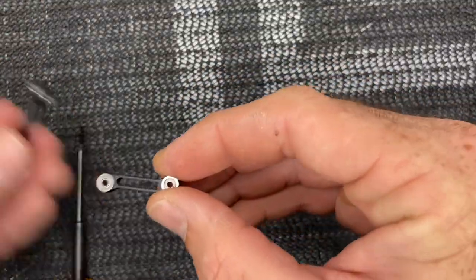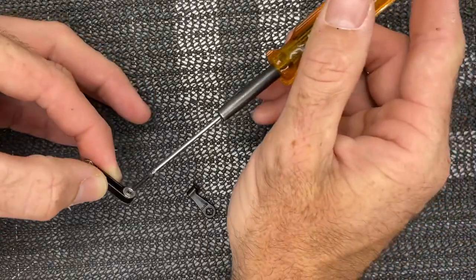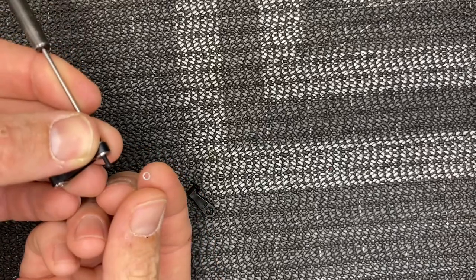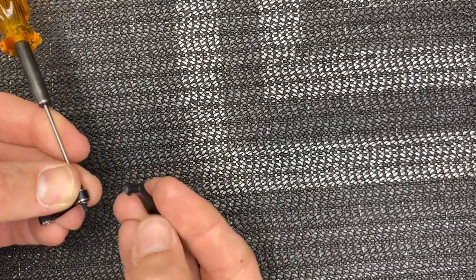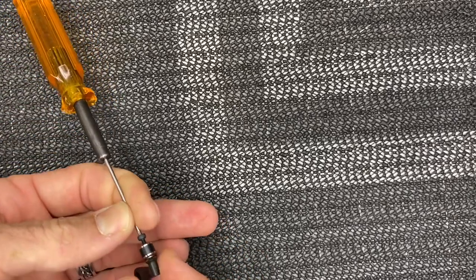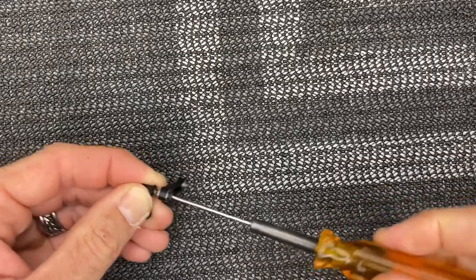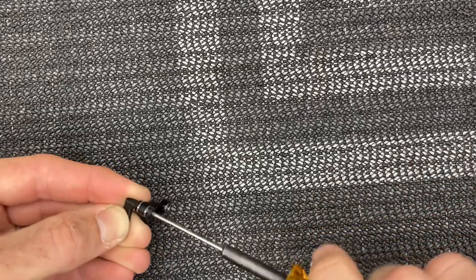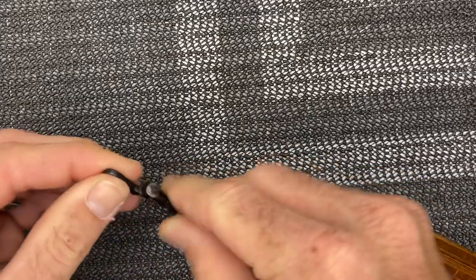Now that we have all our bearings in on both arms, take your arm with the little side facing down, insert a screw through the back side with a 1.5mm driver, slide that tiny spacer washer on, then thread your plastic radius arm into there. Be very careful — it's plastic, so don't cross-thread it. When tightening, don't crank it — you want no play but a free-moving arm.